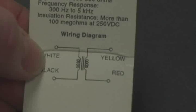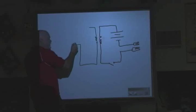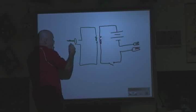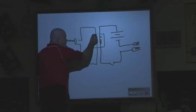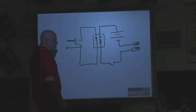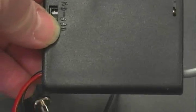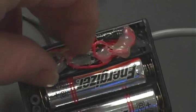On the primary side of the transformer, I simply have the 8-ohm plug that would go to the headphones. This is a stereo jack, but I've got it hooked into mono, so I only have it going to one transformer. The wire comes out of my little battery box and plugs into the headphone jack of my iPod. I get a battery holder from RadioShack that holds three batteries, but my laser only required three volts, or two batteries, so I had a little extra room.